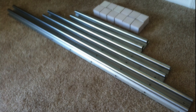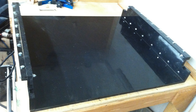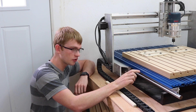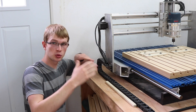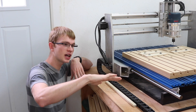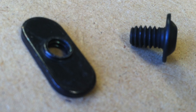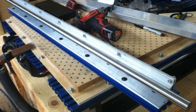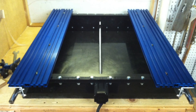The first thing I did was order some 20mm fully supported rails as a set, and these came with the bearings. I then stripped the CNC Shark down to the bare plastic frame. Since my new rails were going to be about nine inches longer than the originals, I had to notch out the corner of the plastic frame to make room. I think it's important for any CNC to have the rails mounted to the table so that if the table sags, the gantry will follow that sag — otherwise you'll get an inconsistent cut depth. So I used some 8020 t-track bolts and nuts to mount a 2x2 aluminum angle to the bottom of the table, and then mounted my rails directly to that, bolting both back down to the frame just as on the original CNC Shark.